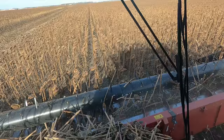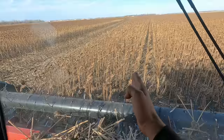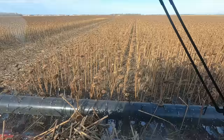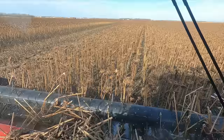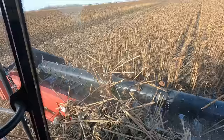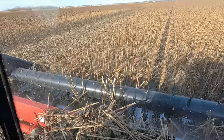You fill up pretty fast with sunflowers — it doesn't take long for them to spill in here. You can see the rows — we planted them in 22-inch rows going that way, and I am combining at a five-degree angle with auto steer. I'm doing that because the divider was kind of knocking some down when I tried going with the rows. Going at an angle now seems pretty good. I'm constantly adjusting my height, floating it up and down — right now going through a taller patch of flowers so I'm cutting a little higher, but I don't want heads slipping under or those sunflower pans hitting the ground.